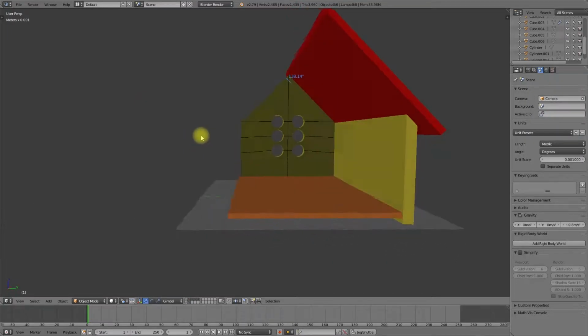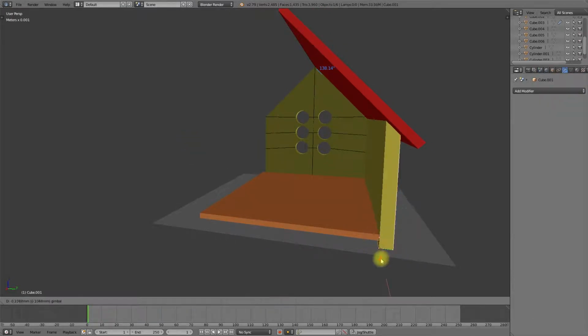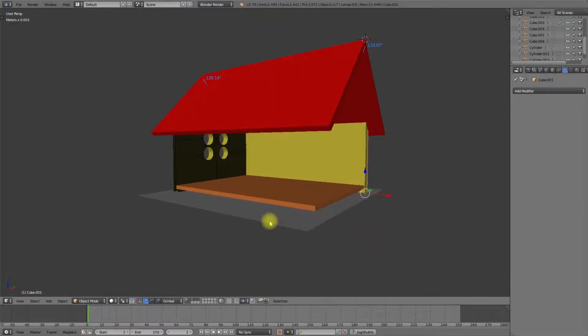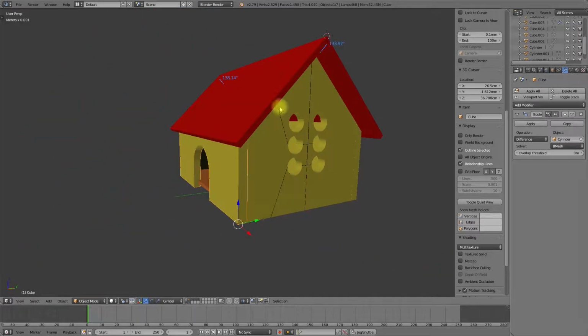The wooden house was originally designed for outdoor use. I used a simple design that can serve you as a template and as a starting point for your own ideas. The material used was 18mm spruce for the side walls and 12mm plywood for the roof and 12mm beechwood multiplex for the floor.